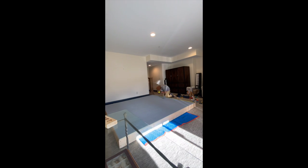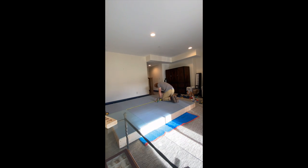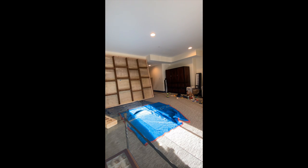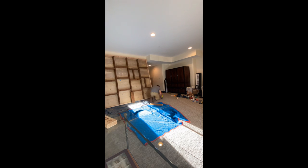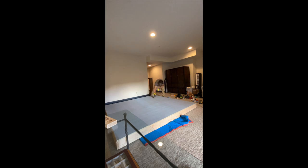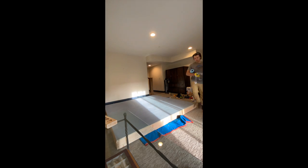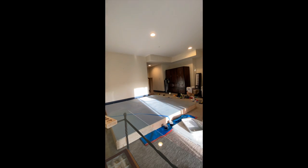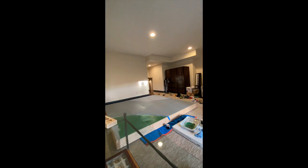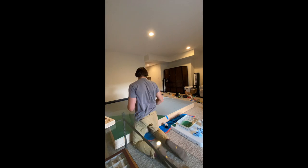Once they're in, I set the plywood sheets on top of the frame, drilled that in with screws on the outside of the frame and also the inside, kind of in the middle. And then here I put some additional braces, which helped secure the plywood to the middle of the wall, because they were kind of bowing out in the middle. I needed something to secure them down to. And then lastly, I'm doing some painting to get my pattern on there.